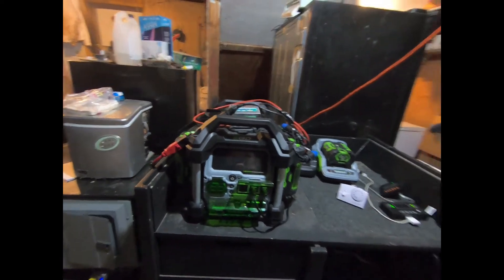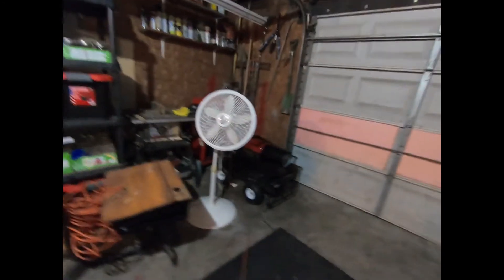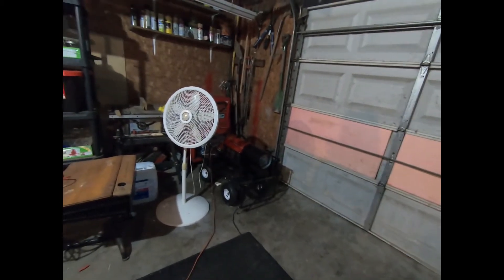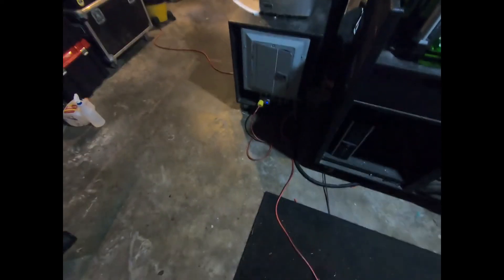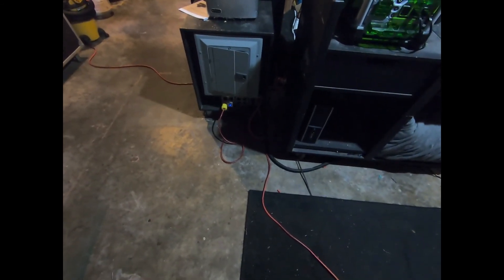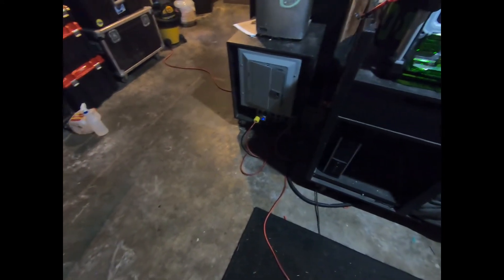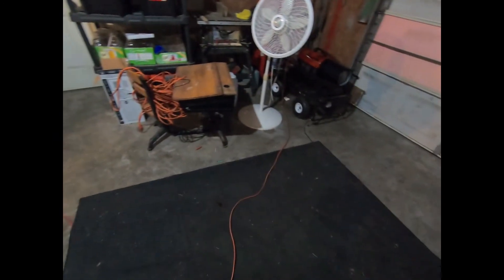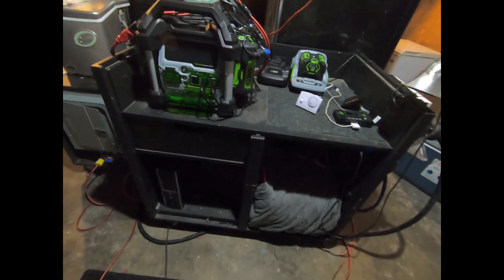Setting these up on schedules is useful because that heater doesn't have a thermostat — it just has a power button on and off. I could control it by temperature if I added a temperature thermostat switch, or just set it on a schedule like running for 30 minutes every three hours. Right now I don't plan on doing that, but in the deep of winter I may set it up that way.